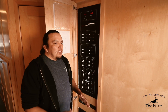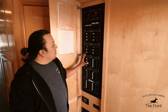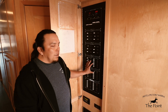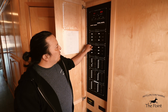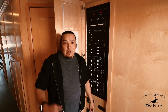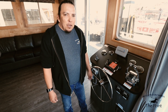If you need to shut the generator down — for example, to get swimmers in the water — the shutdown sequence begins at the panel board. Shut off appliances that run on generator power only; anything running on the inverter can stay on. Turn off the AC handler and HVAC switch, then turn off power transfer switch number two and number one. Head back to the main helm, press the stop side of the generator switch, and the generator will deactivate and shut itself down.